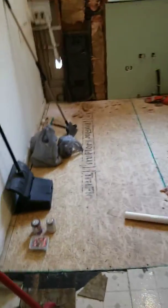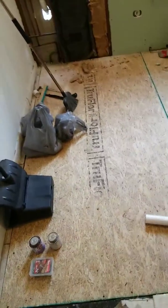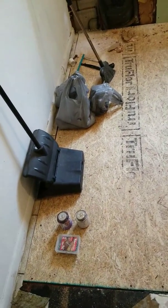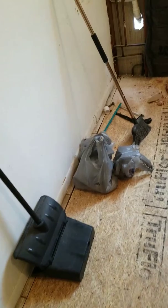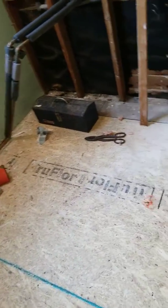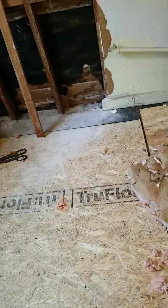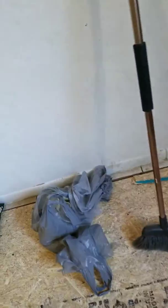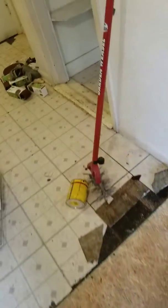What I did today was I got three-quarter inch sub flooring tongue and groove and got it put in. This side had to be cut — I had to make a cut here along the edge to get the old flooring out, so it wasn't quite 48 inches left. This one was almost the full 48 inches; I had to cut a piece of the groove off so we've still got the tongue and groove connection, and it's real solid.